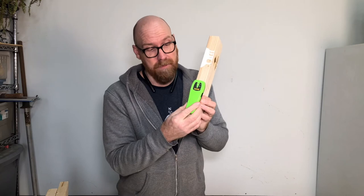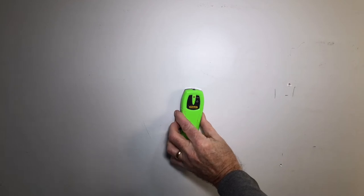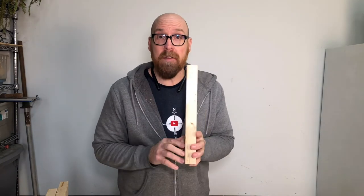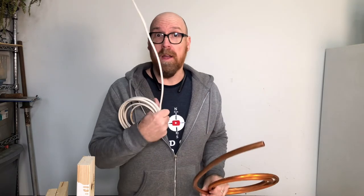About the thickness of the grip of this stud finder. The first step is you need to calibrate by finding a place where there is not a stud. Once you have that calibration, you can move along the wall looking for the stud. Pay careful attention to the thickness of what you're finding — the stud finder may pick up other things in the wall, like a water line or electric line, that are considerably thinner than a stud. You want to avoid things like water lines or electric when driving your screw or nail.